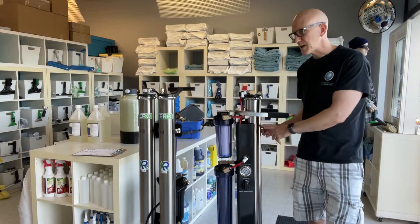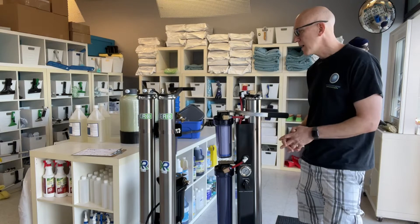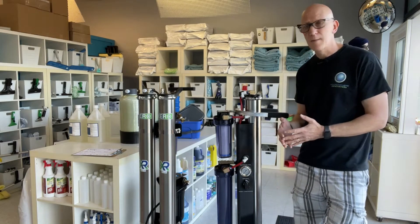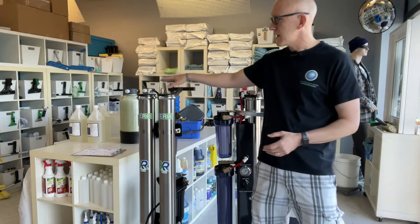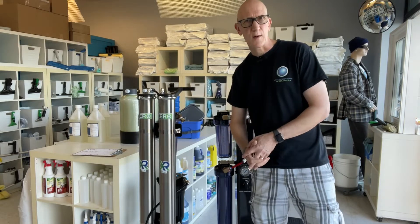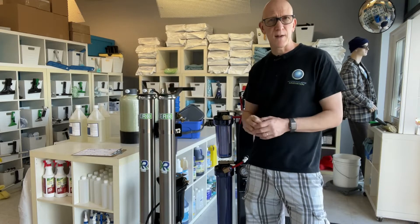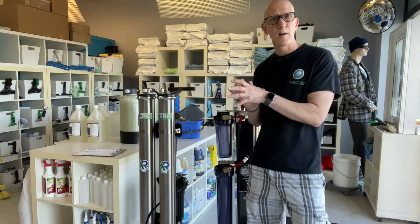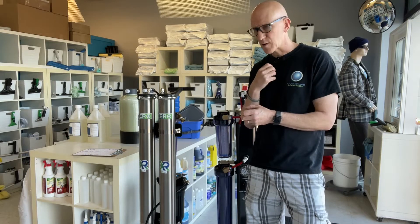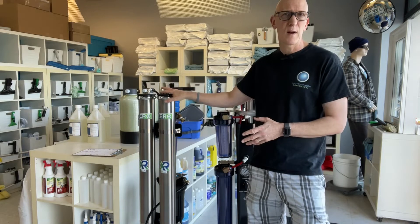Before we get into when it's time to change the RO, let's talk about the maintenance of it. Normally on a system, you'll always have water going out the waste side. On a system like the Zero Pure Revolution and Revolution Max — they call it the Max because they have two RO membranes — these systems are actually auto-balanced, which means a regulator always shoots a certain amount of water out through the waste side so that the accumulated minerals are always going out.